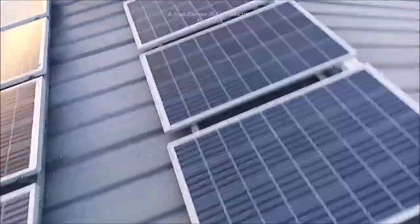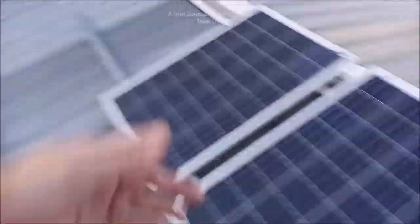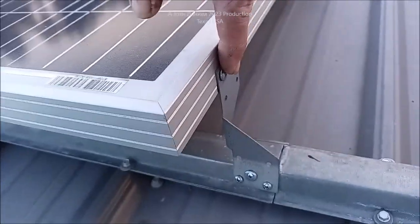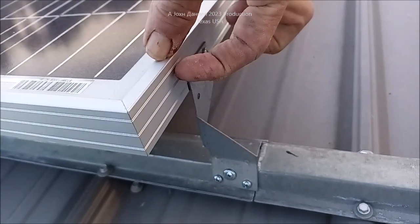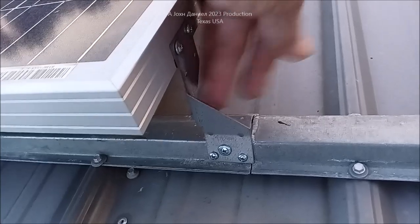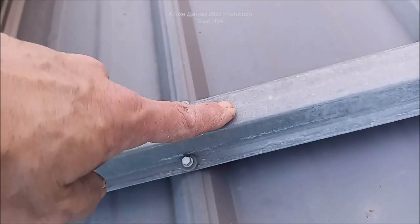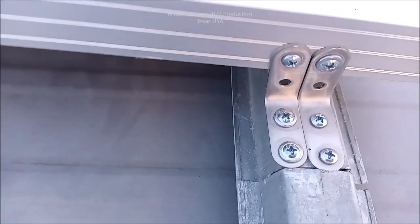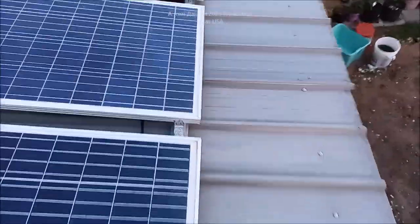A little update on my solar install. I've got a whole bunch of panels here — these are the 120s. For mounting these I use a hurricane tie, 18-gauge, that screws right into the panel below the glass area with stainless steel screws. These are high nickel iron — steel and aluminum — and I've used these for many years. This is hat channel, very durable strong hat channel. These 120s needed that because they'll lift up easier, and we had a 77 mile per hour gust recently — didn't seem to bother them at all.